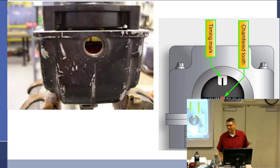It does not tell me E-gap. What does E-gap mean? That's your magnet. E-gap does not mean 10 degrees anything. It's the number of degrees past neutral at which the points open. Do the points open every single time it's going to spark every single cylinder? Yes, that's how it works.